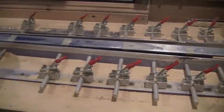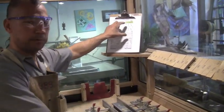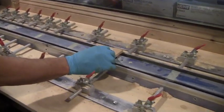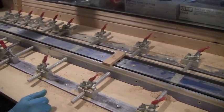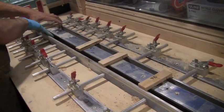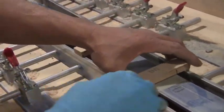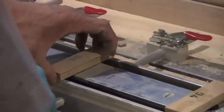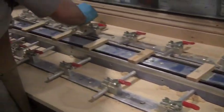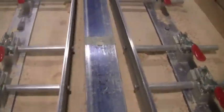Okay, so we're all set up, ready to go. Let's get started with building the ski. So this is a set up rig for one ski. After the ski's been designed, we get a shop copy that tells us in this little section how to set up what we call the rail package. So the 94 block goes in the center line, and then I'll just put the other blocks in. If you look down this section, you can actually see the shape of the ski.